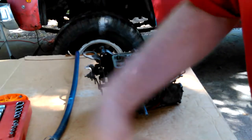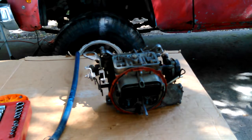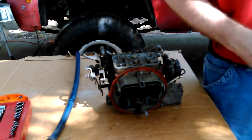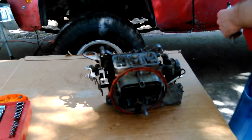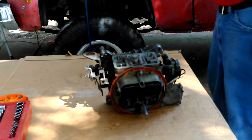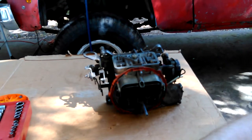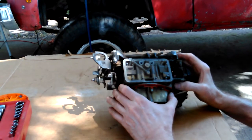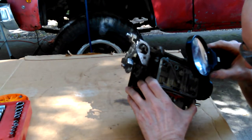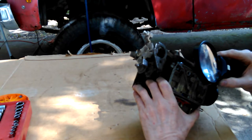I'm really starving — I think I'm going to quit right now. The threads are buttered up in here. I guess I messed them up before. Somehow managed to get it back in there. I'm going to look and see if I have a tap with the right thread, or find something pointy enough to work on. It's aluminum — I can dress them up. Looks like I got the last one in there cross-threaded and then finally got it straightened out, because it came out easy.